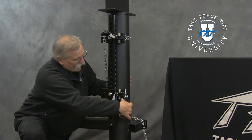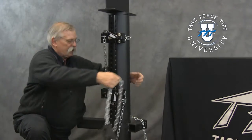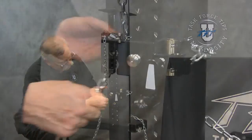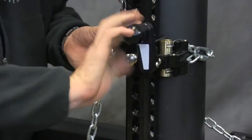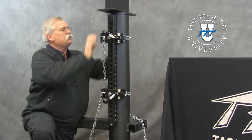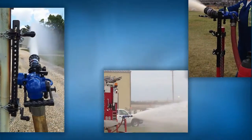The chain is held in a bag like right here, and I'm just going to go ahead and pop and deploy the bag out. You see you've got all sorts of chain that you can wrap around. We'll bring it around here, and then bring it in and take it up, and it'll just hold on a single chain, and you just start to tighten down. That's it. You've got an incredibly stable place right here. The chain is holding it in place in a couple of spots, and you'll be able to very easily hold the reaction force of up to 500 gallons a minute through the hemisphere.